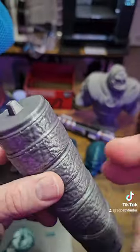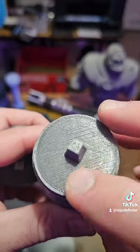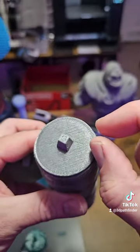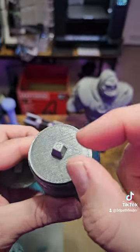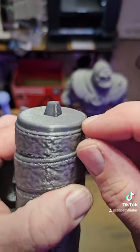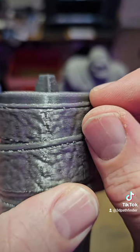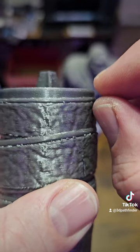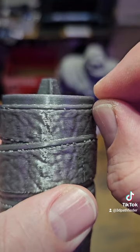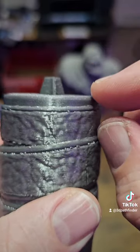This is just one of the things you can do with multi-material: it's not just about printing different colors. You can use multi-materials in one print to support an object — PLA supporting PETG or PETG supporting PLA — to get much cleaner supports. Traditionally, the way to do supports is to change the top Z offset distance.